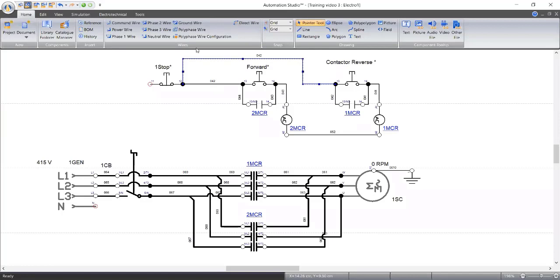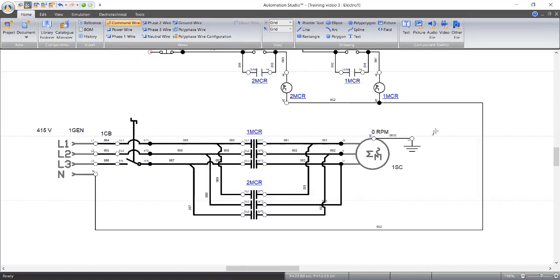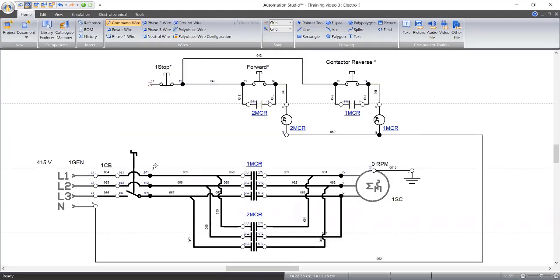Remember, it's even magnetic, and we are not using transistors. You know, transistors can switch very fast, but we're using a contactor. So that means we're not safe. Yes. So now, we don't want complexity. At the end of the day, we'll talk about cost too. If you want a system that will deactivate that one, like I said, you still need another coil that will deactivate it, and that will cost us another amount of money.